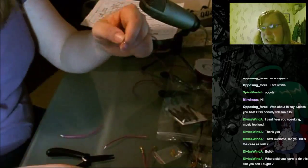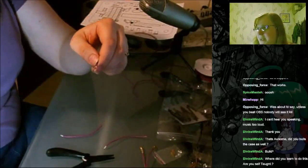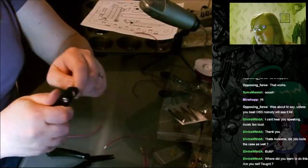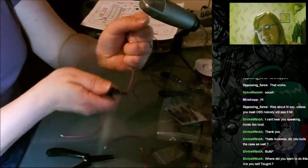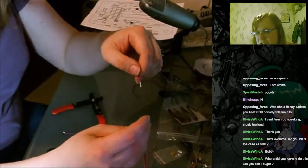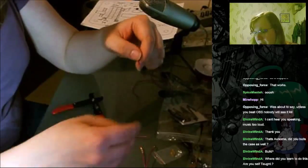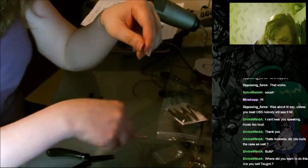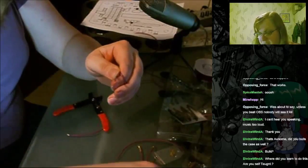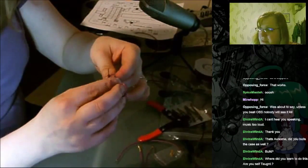Now what I'm going to go into here briefly is soldering. I found that the crimps needed to be soldered for the ones which you've got multiple jumps on. So what I'm going to do is, because I've got to twist multiple wires together, I'm going to take this one, I'm going to take a little bit more than I need. I also found out that while you're supposed to use the strain relief on it, I couldn't get that to work, so I basically just crimped the whole connector, the whole core on there for these jumps with the other ones. So let's prep the other jumps and reuse these offcuts. And then you start twisting them together.